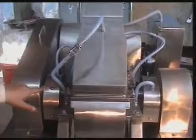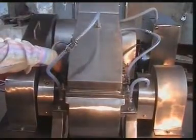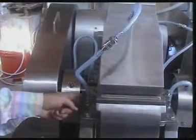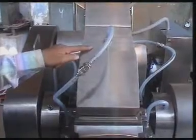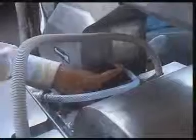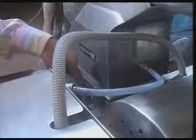This is the inlet of the water jacketing system which goes into the pillow block and comes out from the pillow block, then enters into the chamber. From this entry, water comes out from this side and enters through this pipe to the throat hopper. The water gets filled up around the whole throat hopper and comes out from the rear side of the throat hopper, then circulates through this pipe and enters into the other side of the chamber.